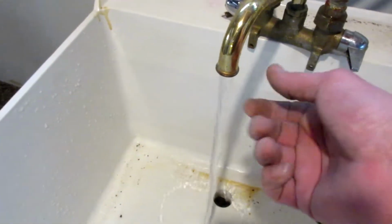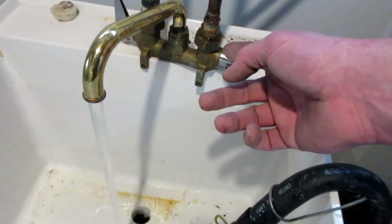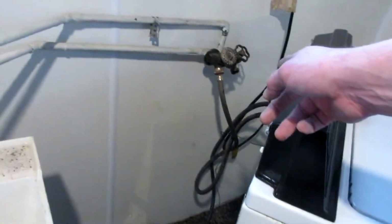Normally it clogs the aerator on bathrooms and kitchens. This one didn't have one. I didn't think it was going to clog that up, but I could have just simply pulled off the garden hose end and let it blow through there. So with that being fixed, I realized that this drain pipe was loose. I tightened this up. Over here, I got no drips, no leaks. I'm gonna come down and check it in a while after I've had pressure on this. And let me clean up the mess that I created here again and regroup upstairs.